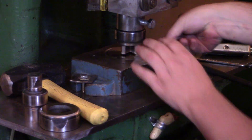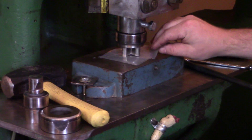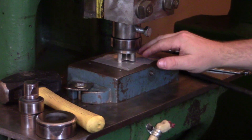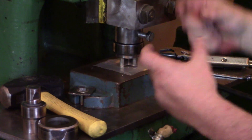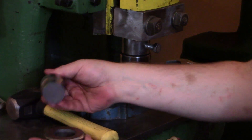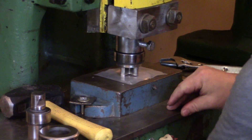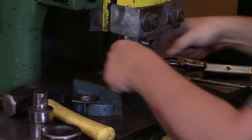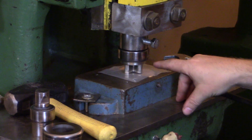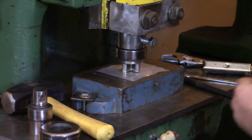You could do this by eye, but this is a trick an old tool and die guy taught me. He actually used nylon, which was really cool because it stretches real well. But plastic in this case will work just fine. What it's going to do is take up the clearance between the punch and the die and get it nice and centered. Like I said, you can do that by eye, especially when doing circles. You do get a touch for it. I've also seen people put light underneath so they can see the light and shadow around. But I've found over time that this is the quickest and most effective method when dealing with extremely tight tolerances, because it just takes up that clearance perfectly all the way around.